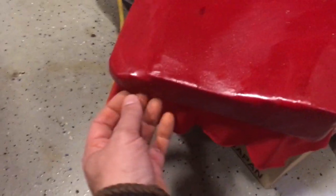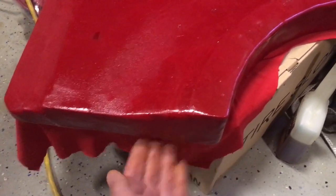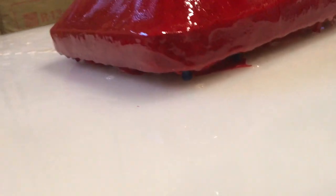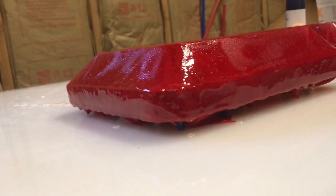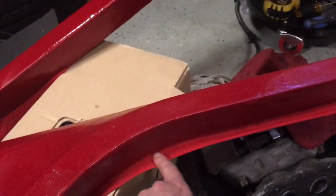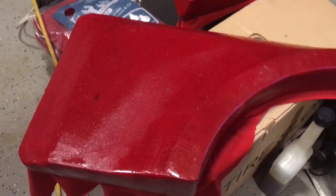And I think I might have to go around the edge and maybe cut like 1/8 off this lip, because a lot of the resin dripped and worked its way around. You know, these were held with push pins, so basically it was suspended in air, kind of like these parts are right now. So you could see as the resin drips around the sides, the resin shell actually wraps itself around the buck, so it's not letting me pull it out easily. So I'm gonna have to get a Dremel and cut maybe the bottom 1/8 of an inch off of everything around the full perimeter to get it off. But yeah, I'm gonna order some more materials, and then we'll jump back into this.